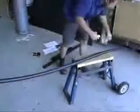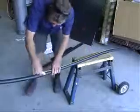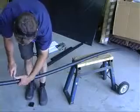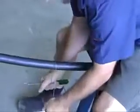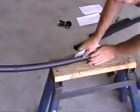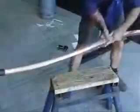The following steps outline the upper termination of the high voltage shielded cable. Remove the black PVC outer sheath for a length of 165 centimeters by cutting radially around the HVSC cable with the supplied friction tool. This is less likely to damage individual copper conductors than cutting with a knife. The lengthwise cut is completed with a knife — do not damage the white inner insulation during the process.